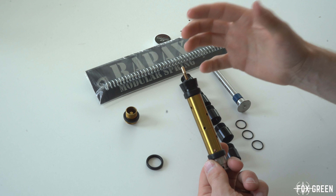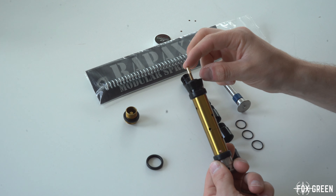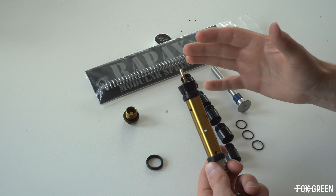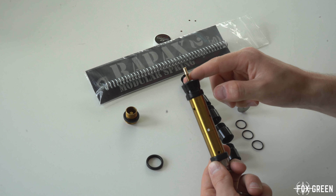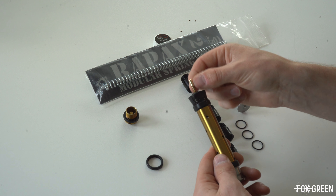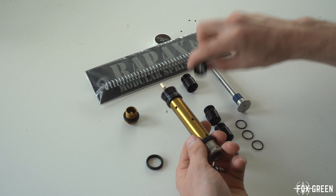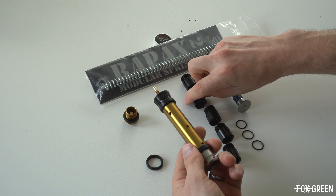The longer you make the air brake, the bigger the air cushion it forms in front of the piston, making it quieter. The less you extend it, the smaller the air cushion. And the longer you make it, the more effect it has on FPS — but by changing weights you can counteract that, so this is a really good setup for fine-tuning.